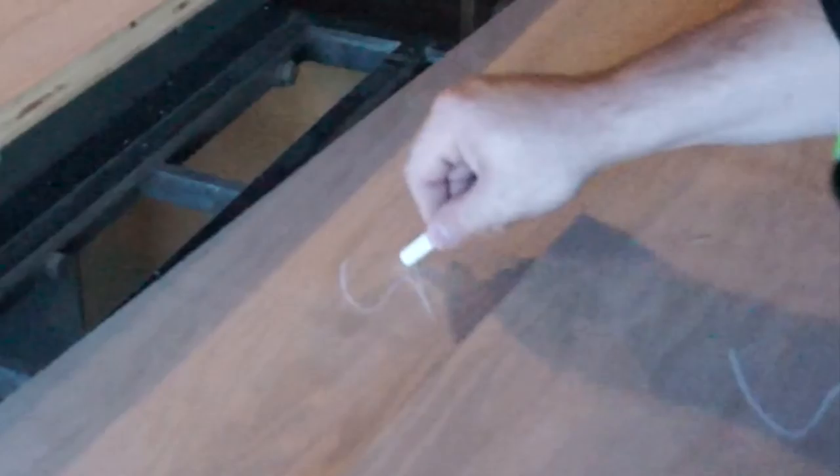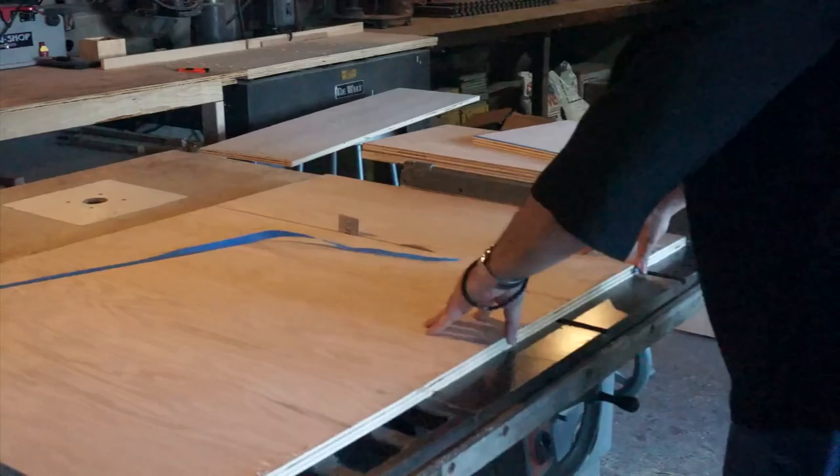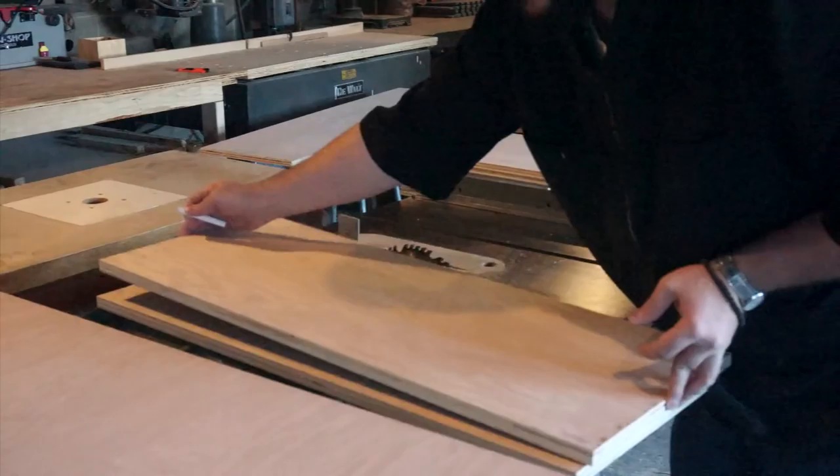Because of the design of this cabinet and the amount of plywood I had to work with, one of the shelves needed to be cross-cut. When I need to do a cross-cut, I typically like to put down a little bit of masking tape on that particular cut on the show side in order to minimize any potential chip-out or breakage that might happen on the veneer.